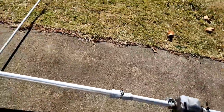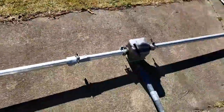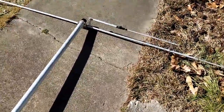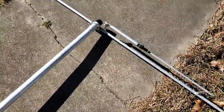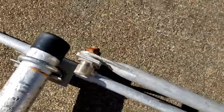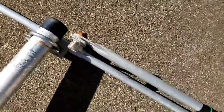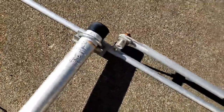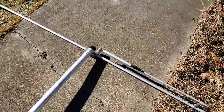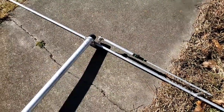It won't turn right now, so I'll have to take that apart and see what happened inside - the bird had to have hit it pretty hard, it's bent right down here by the boom. I also had to take it down because the gamma match started giving me trouble again. That aluminum is in rough shape and it keeps losing connection - the nut's rusty too, though it has a good stainless steel washer behind it.